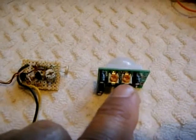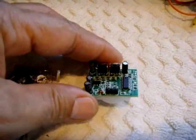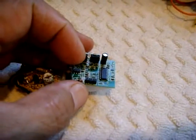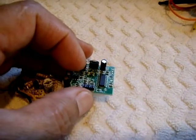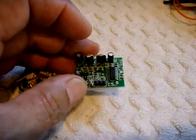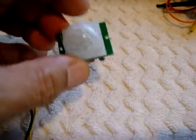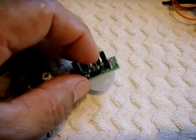It's very easy to connect — three pins. It takes up to 20 volts, but I'm running it on 6 or 12 volts and it works perfect. One pin is the plus voltage in, one is ground, and one is the voltage out. The voltage out comes out to around roughly 3.3 to 3.4 volts once this is activated, so if something moves in front of this you're going to have roughly 3.4 volts on the output pin.